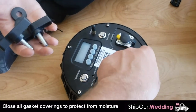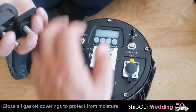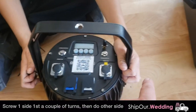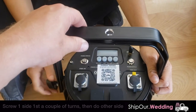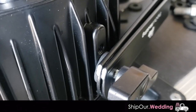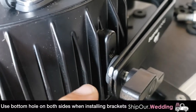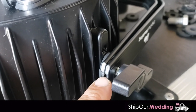Things about your lights — you want to make sure that all of these are fully pushed down so if there's any moisture outside, water does not get inside of the light. These are waterproof so you will be good to go. When installing the brackets, make sure you install it in the bottom hole and not the top hole. You want to install on the same lower hole for both sides of the fixture so your bracket attaches evenly.